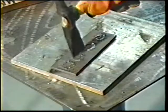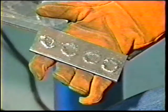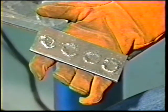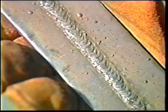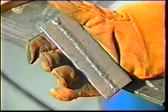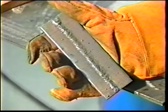Use the chipping hammer to remove the slag. After the plate is filled, call your instructor. The next step in learning to strike and control an arc is running a bead. A good bead will be even, smoothly rippled, and about the width of two electrodes, with little spatter. Correct travel speed, current, and arc length will produce a continuous, crisp, frying sound.